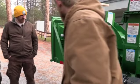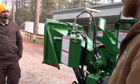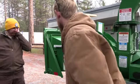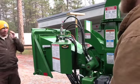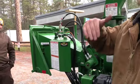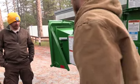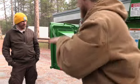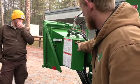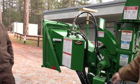We have our level gauges here, guys. Bandit's going to give you a breakdown of the terrain you can keep this machine on, but essentially follow these levels. These are going to be your best way to go. You do have oil sensor settings in this engine. So if you get this machine on too steep of a grade, it's going to shut itself down. But before that happens, just take a quick peek. This one is obviously side to side, this one up and down. If this bubble starts to get into the orange, you shouldn't be taking the machine there.